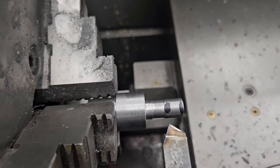All right, it almost fits. I need to trim just over 1/8 inch off the end, so I'll face that in a minute. And I need to widen this little recess, which is going to allow that bolt to go through the arbor press and kind of hold it in. I'm keeping that extra wide. The bolt itself is only a 5/16, but I'm going to make this little recess about 1/2 inch wide.